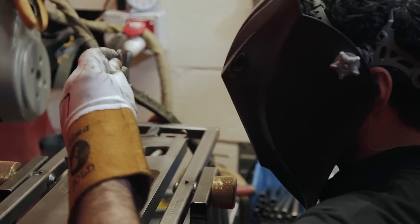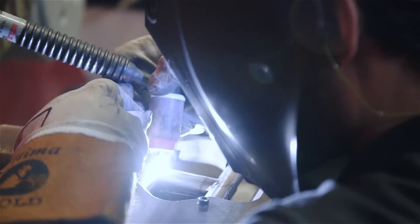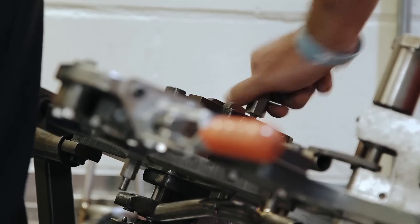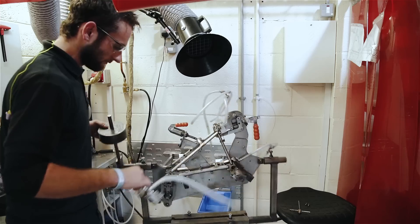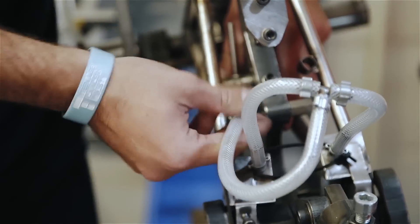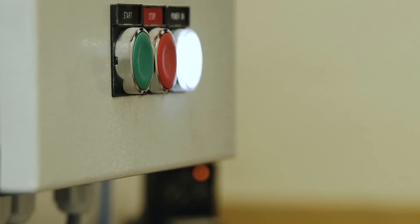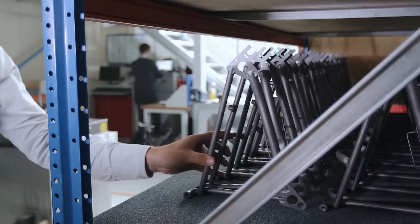To ensure good quality in the product we put an awful lot of attention into avoiding any contamination in the welds, ensuring all our parts are very clean and designing purpose-built jigs that keep the weld backed with argon gas, avoiding oxygenisation that may lead to embrittlement. It's then finishing processes that give a nice consistent finish before it's packed and sent back down to Brompton.